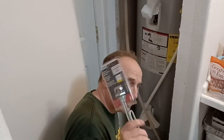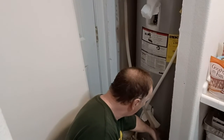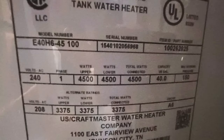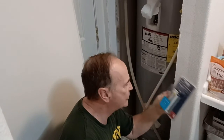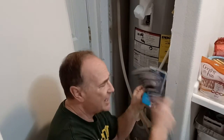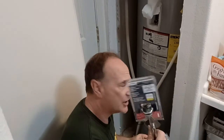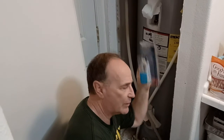I stopped by my local hardware store and got this new heating element — 4,500 watts. They've got a little tag on the old one that tells you what rating you need. I also bought this element wrench to go with it; I had one but it was old and didn't work well. This wrench was $14.99 and the element itself was $15.99 — it cost about as much to buy the wrench as the element. But we'll keep the wrench for future use.